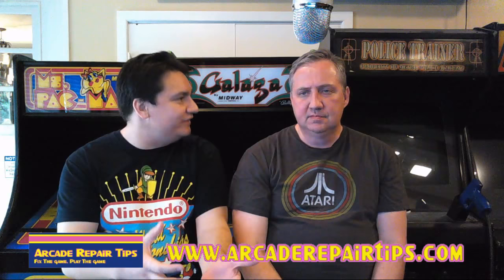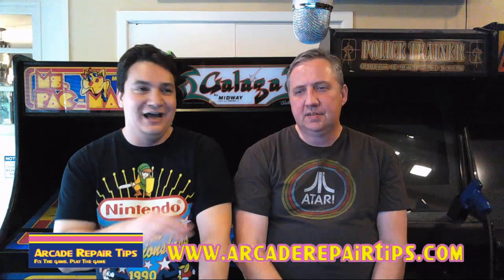Okay, Tim, so obviously Chris has been watching our horizontal width coil video, where we show adjusting it. But he's saying it's not making any difference in his picture when he adjusts it. Now, Tim, we're assuming he's using the right tools. Yes. So make sure you're using the actual horizontal width or TV alignment tools, which we have a link to on our website. You can get them from several arcade parts retailers, right, Tim? Yes, not an Allen wrench.